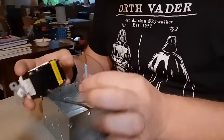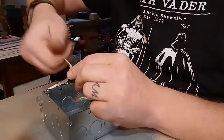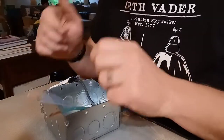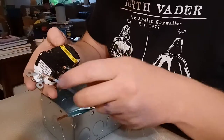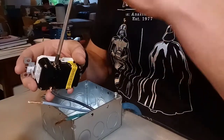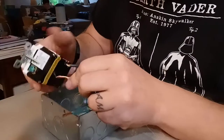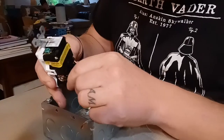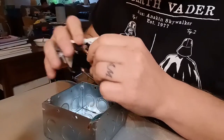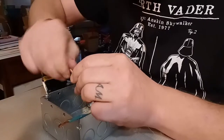For some reason the white wire is colored blue in this cord. I know it should be the white neutral because the other one is black and the other is green — so this is the neutral. It gets plugged into the silver screw — white goes with white, even if the white is blue. Now if you're watching this and you're colorblind, you're probably really confused right now.